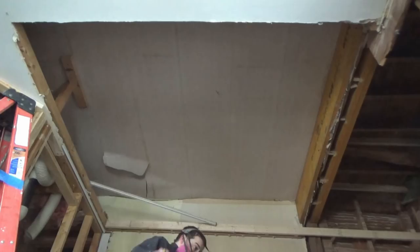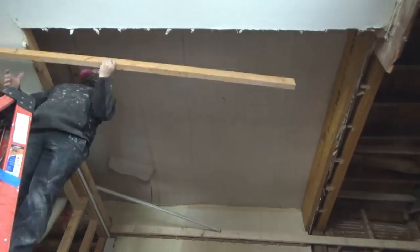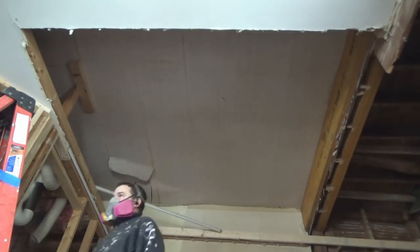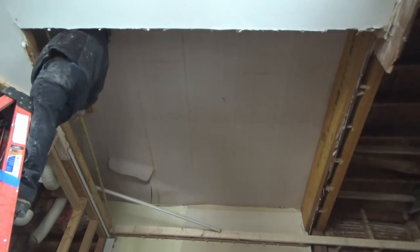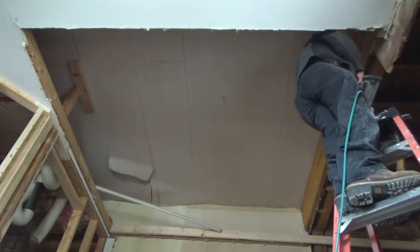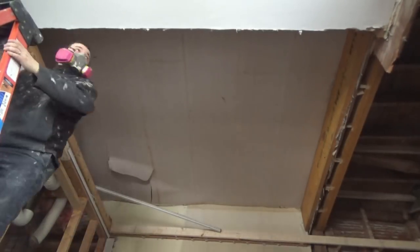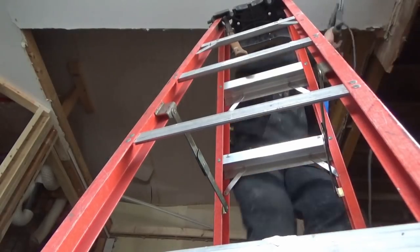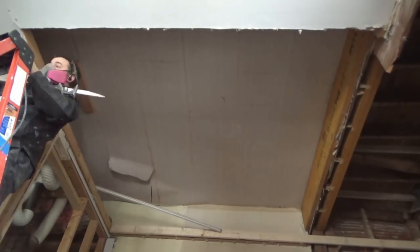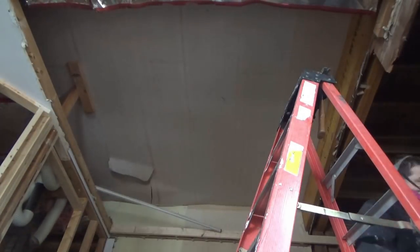You can see I just built that wall out. There was a bunch of mess to deal with, so instead of trying to clean up the wall framing and shim things out, we just built that wall out and dropped a brand new wall under it — you'll see that in the tour video. I plated that, I'm leveling everything, and I'm making sure everything's square, because that's really important for a ceiling like this. You need everything to be square or you'll have a lot of trouble once you start laying your planking. Here's where I'm cutting the drywall out and knitting back the sheathing.